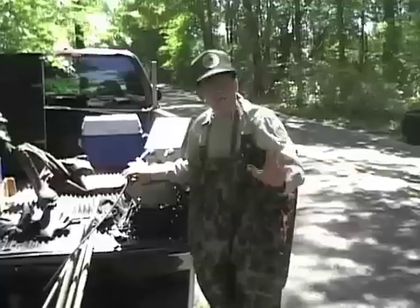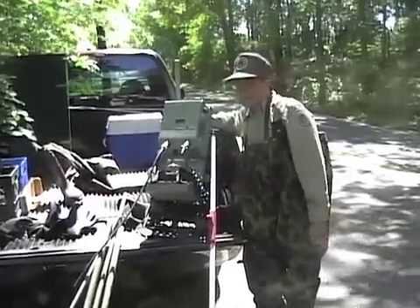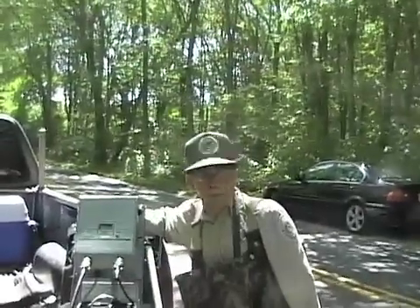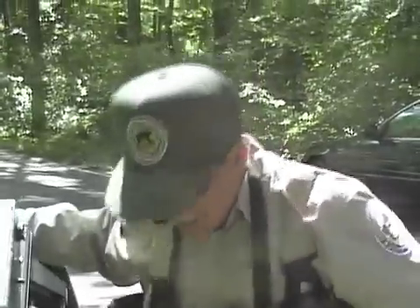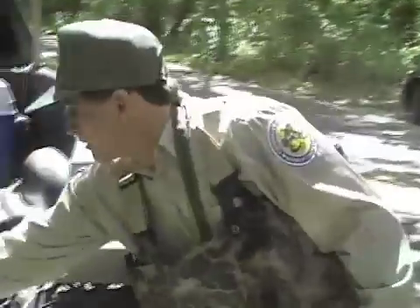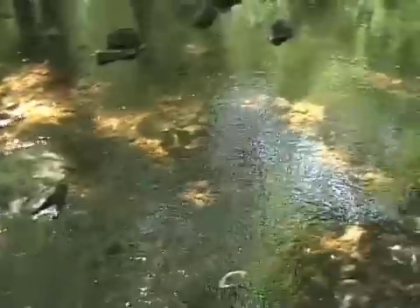That's when we'll dip the fish up with the nets and put it in a bucket. The fish should recover within a few seconds to a few minutes, depending on the charge they get. This is the standard sampling gear for small streams throughout the country. For the safety briefing: electricity and water don't mix — you don't want an electric charge going in the water without protection, as it can be dangerous. Your heart is an electrical instrument, and if this electric charge hits your heart at the wrong moment in its beat, it could cause your heart to stop. To avoid that, we insulate ourselves from the electric current — we'll all have waders on and rubber gloves.